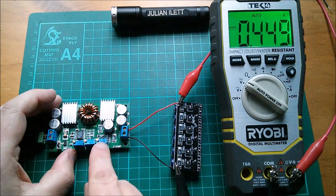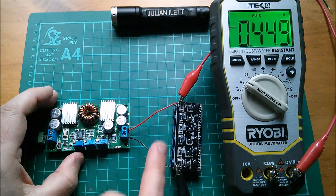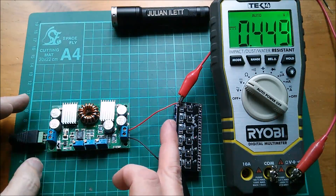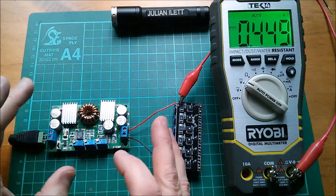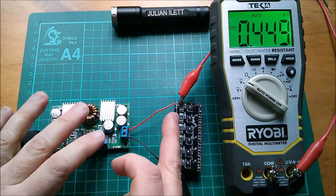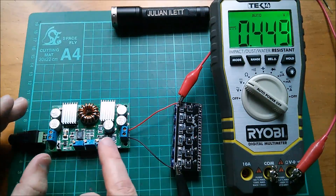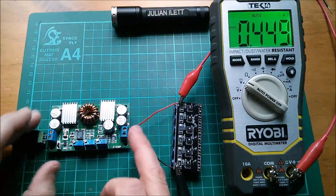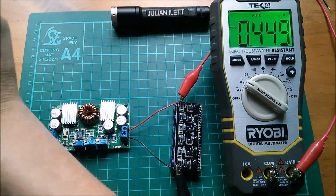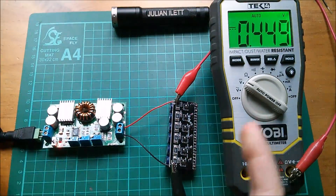Then I can inch the voltage pot up to get these up to 16.2 volts. I don't have any indicator LEDs on these, so I won't be able to see whether some capacitors reach their maximum voltage before others — I'm working a bit blind. Maybe I'll take it up to 15 volts rather than all the way to 16.2. My undervolt lockout should be set appropriately since I had a bulb on here. I think we're ready to plug in the input supply and see how quickly this goes up.